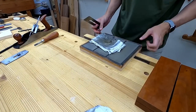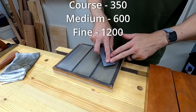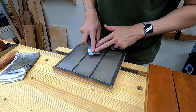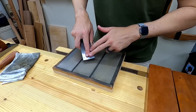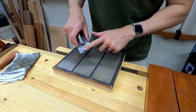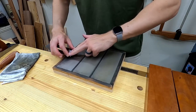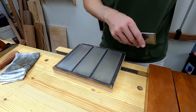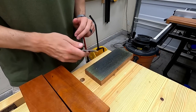Now for diamond stones. On the coarse stone I'll grind the primary bevel. On the medium stone I grind the primary bevel and add a little bit of a camber. And on the fine stone I do the secondary bevel, then feel for a wire edge, and then do the back. Then you move on to the strop — and with diamond stones it's important you've got to strop at least twice as much as you would with oil stones or the blade just won't be that sharp.